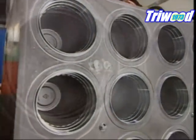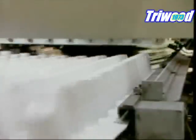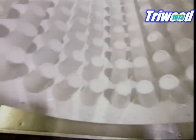The factory uses molds to form this continuous sheet into plastic cups. First, the sheet passes through a 3-meter-long oven that heats the hard plastic until it becomes malleable. Then it enters the thermoforming machine, which simultaneously pushes and vacuums the sheet into the mold cavities, forming row after row of cups. The entire process takes just 3 seconds.